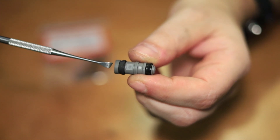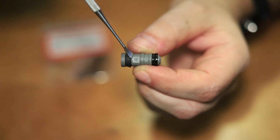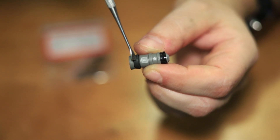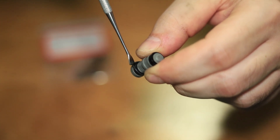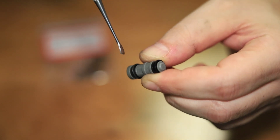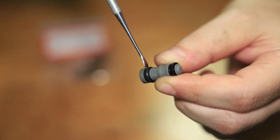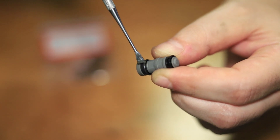This is the piston — when you pull your lever, it pushes the rod which moves in, and these seals are called skirt seals. The way they work is when it presses in, oil fills the gap of these seals and expands them, putting pressure on the side walls. For the front seal that's exactly what you want, but for some reason Shimano uses a skirt seal on the rear as well, and that's where the issue is. Skirt seals don't seal as well if there's no pressure being applied, so as your lever sits there and you're not pulling it, oil tends to find its way around the skirt seal.